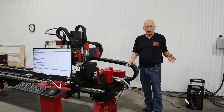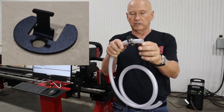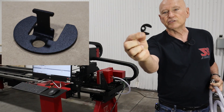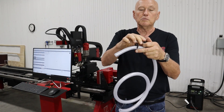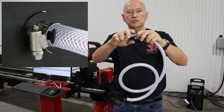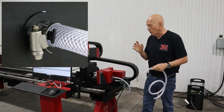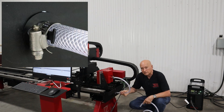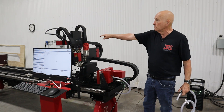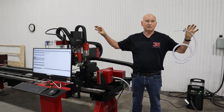In order to keep all of the tubing in place, we've got these little brackets right here. You can see this little fitting — they basically just fit onto the tube, and then you simply take your hose clamp and place it onto it and tighten the hose clamp. Don't over-tighten the hose clamp because you don't want to compress the tube and choke it off — just snug. What these will do is prevent the tube from being pulled into the machine. On the other end of this vinyl tube, we're going to have another one of these that will lock the tube in place so that it can't shift left or right.